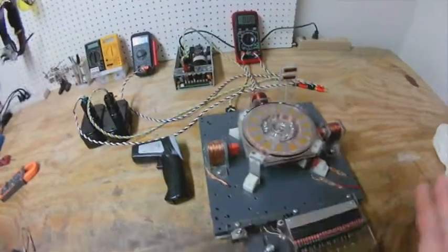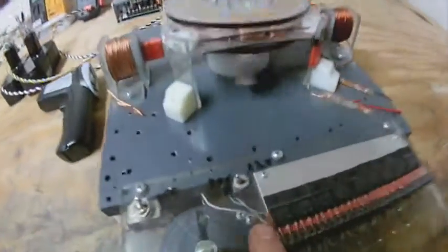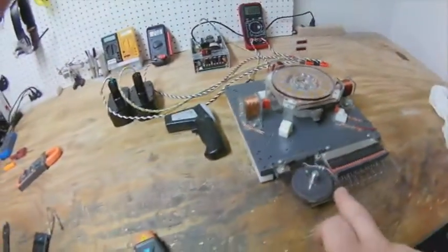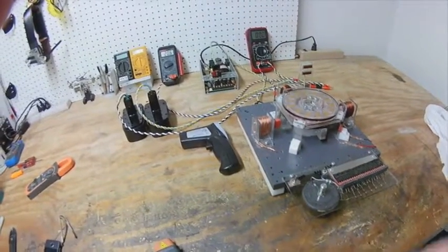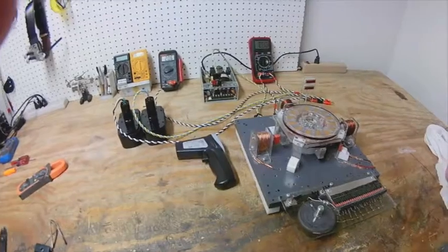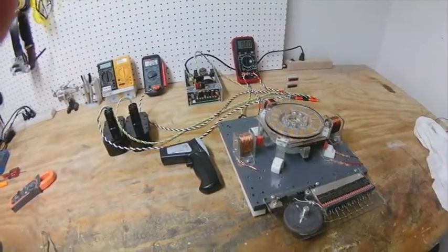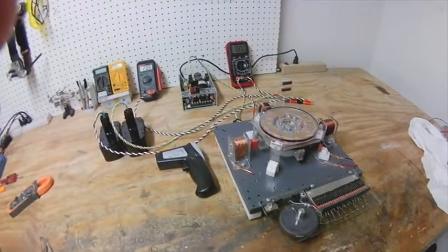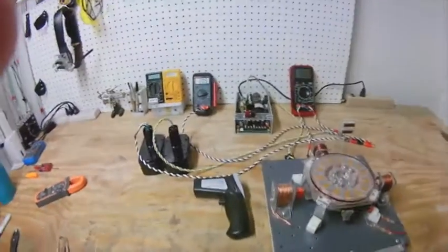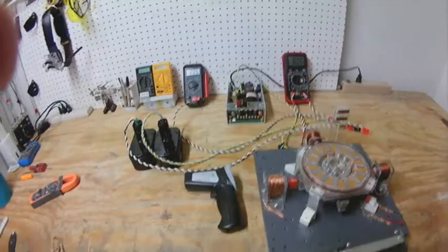What we could do is apply a boost switch - you can see I have a switch here, I disconnected it. That boost switch can be set up for that other resistance level: we take one circuit, figure out the sweet spot on that circuit, then apply that across the other two circuits, and add a switch that triggers the other resistive level of the circuit.